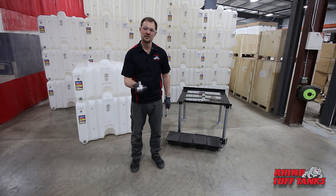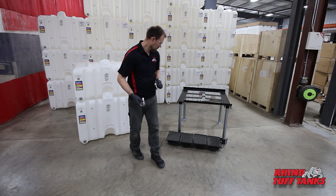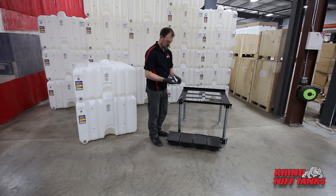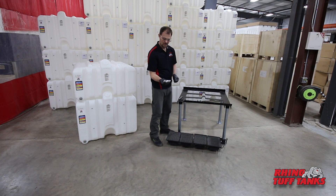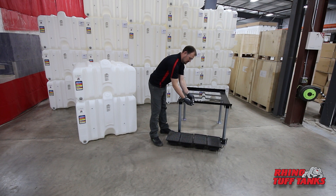In this step, we'll be attaching our elbow kit to the front lip of our stand base. You'll need a 9/16-inch wrench. The elbow kit comes with a 5/16 bolt, lock washer, and a nut. Guide the bolt through the hole on the front edge of the stand base — the front tab of the elbow kit will rest on top of that front lip. That gives it structural stability and will not allow it to turn once it's tightened. Hand tighten, then use the wrench to snug it down.